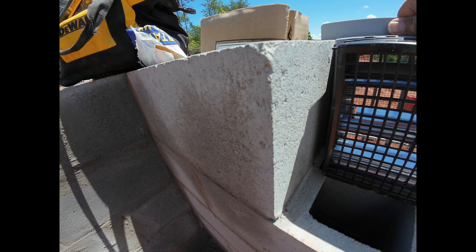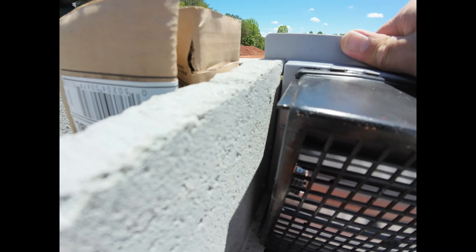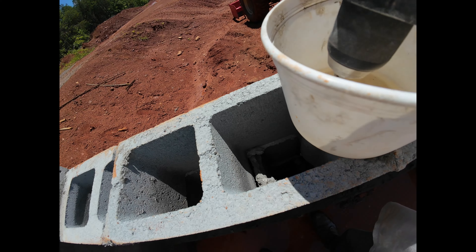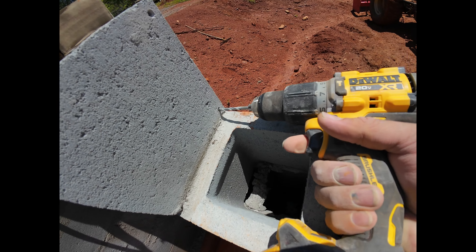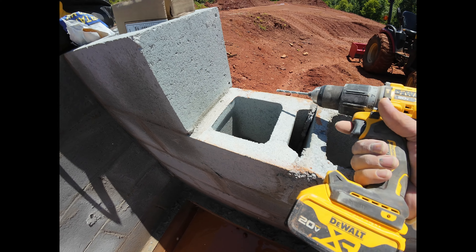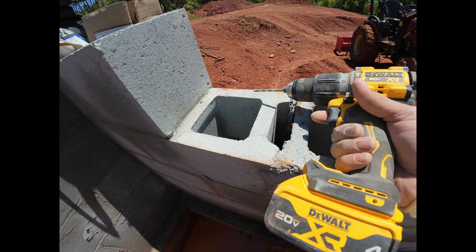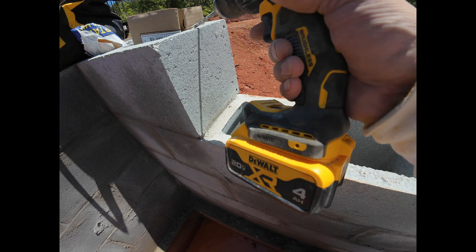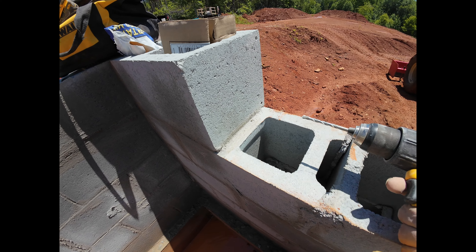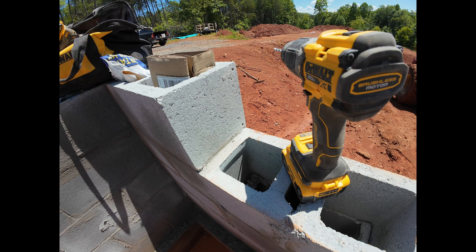I put it up and check — yeah, that fits perfect, slid right in the hole. Then I guess on the bottom one, pull it out, drill that one partially, and slide these in. They're pretty much lined up. Then I go with this drill, dip a little water just to keep it cooled off. I'll drill this and make it a little bigger than it should be because I'm going to put some expanding sealant in there, plus mortar going around and a top seal on top.